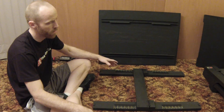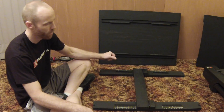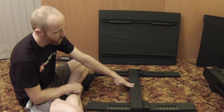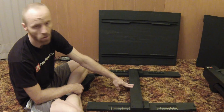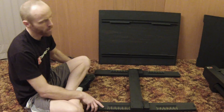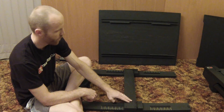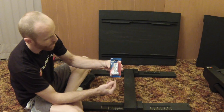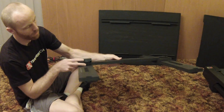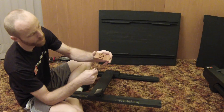For the base, start with a 1x4 piece of lumber — a standard 8-foot length gives you enough material for all the pieces with a little left over. You'll need two pieces cut 32 inches long, one center bridge piece cut 24 inches long, and two pieces cut two inches long each. Start construction with the center bridge piece. You'll also want to get some hinges — I found the two-and-a-half-inch wide narrow version works really nicely.